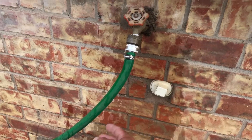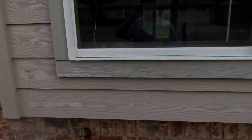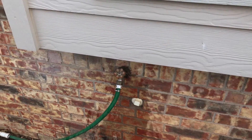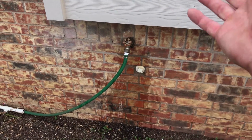You can see the water that came out of this backflow preventer — that stuff in there can keep getting sucked in and eventually get back into your water supply. In this house, the kitchen sink is right here, so eventually that stuff could contaminate the whole house. One of the main reasons you have a backflow preventer is to keep things from going back into your water supply. It can happen on your hose bib, as you can see with these heads.